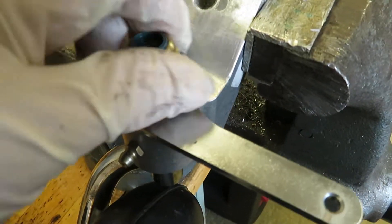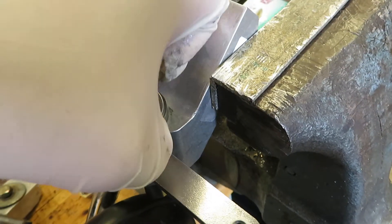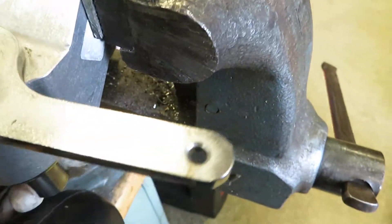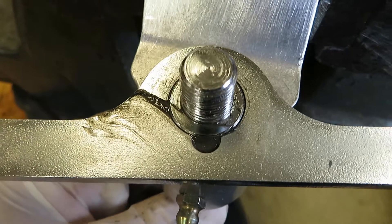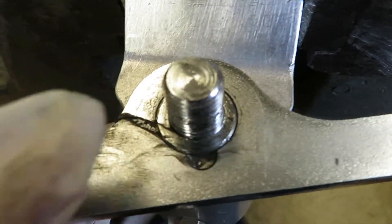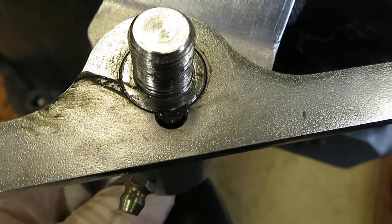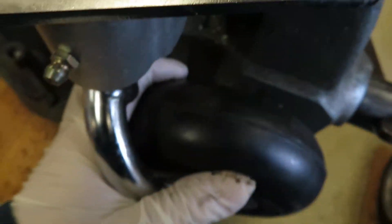Here's how it works. I'll take the nut off, washer, and all this. I don't know how I'm going to do this with one hand — I'm not very good at this. Down here you see there's a little spring-loaded pin right here. So when you pull on the rudder pedals, your steering cables — this is engaged right there. But if you go too far, there's a little cam mechanism where it will actually throw it out into full swivel.